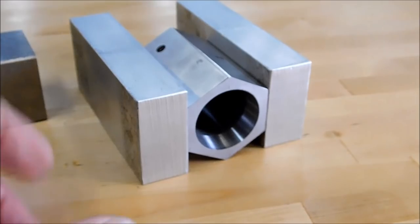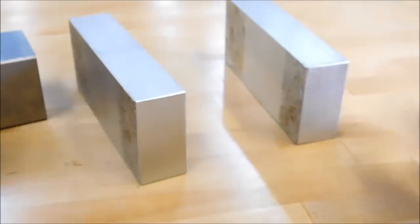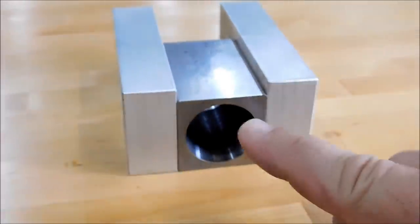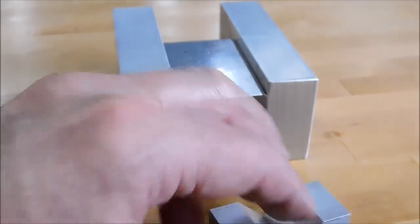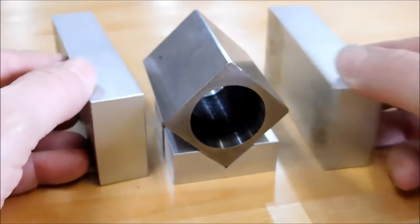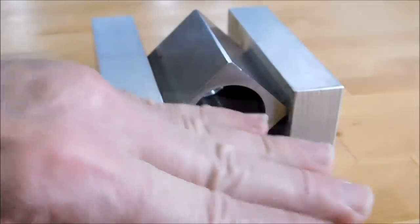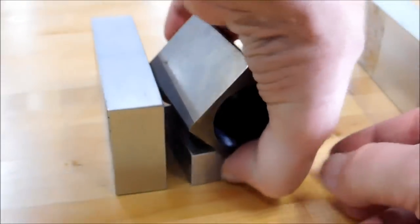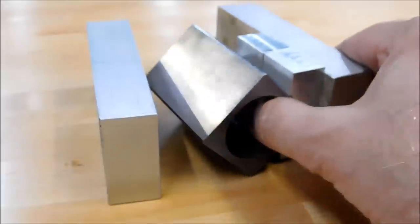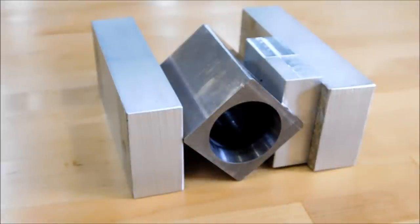This is an affordable and very nice option. This block will give you three or six sides depending on how many times you spin it. Here's a little trick: this block will also give you four options, but it will also give you eight options. What happens when you put a square in a V-block? It turns into 45 degrees. Back to my 'don't hold it that way' — if I had to do this, the 45-degree option with the V-block on a square gives 45-degree increments. You can also put this in your vise this way, giving you a very positive registration area against the back side of your vise. I'll put that on the machine and show you exactly what that looks like.